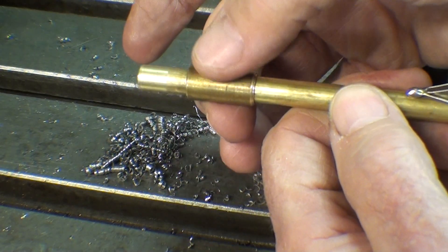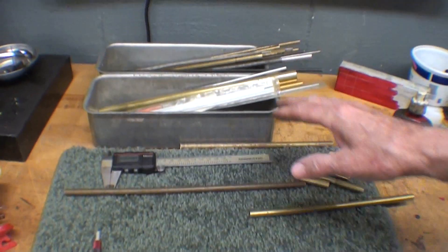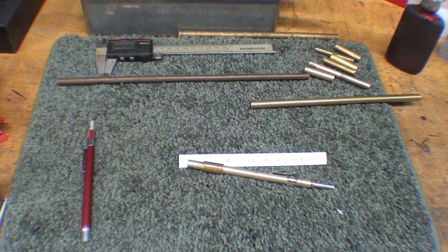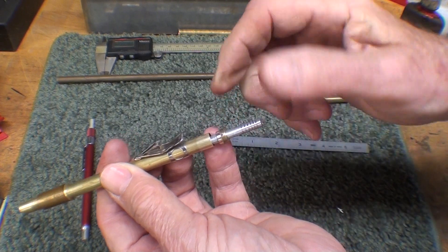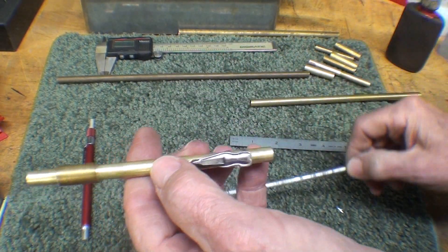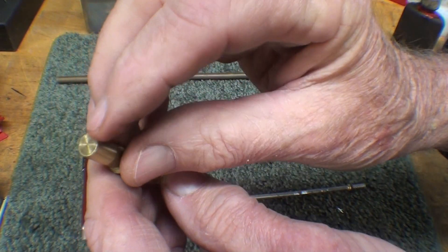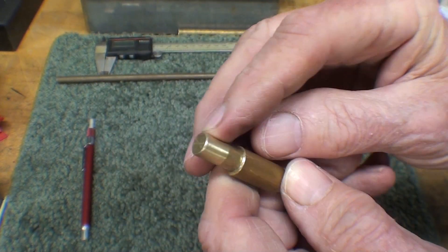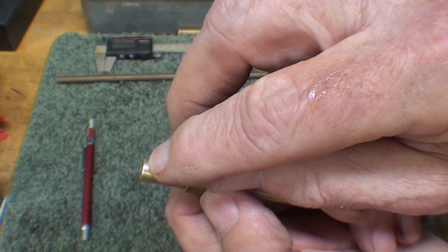If you're going to make one of these, make it a little bit thicker than what I have right here, which is 3 eighths. The material to be used is hobby brass — you can get that at any hobby store or hardware store — and I use 5 sixteenths diameter. This is just a piece of 5 sixteenths thin wall tubing. I did solder the end on. I tried Loctiting it but there was such a short length of engagement that was kind of a failure. So I soldered it, turned it down, and that makes a nice end cap — a sixteenth or less thick.